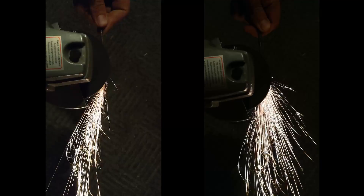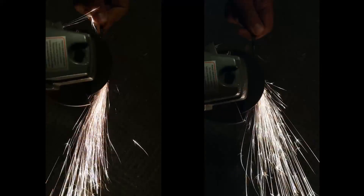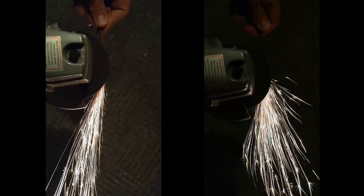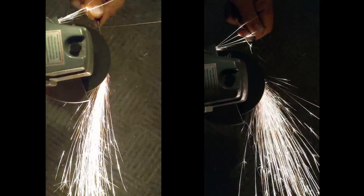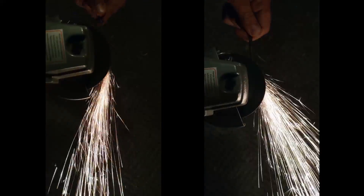On the left is an ordinary mild steel nail. On the right is a nail that we put through the Aristotle hearth. There's little or no difference between the sparks emitted from these two nails, meaning that they likely have the same amount of carbon in them. So unfortunately, little or no carburization took place. Most likely this is for one of two reasons: either we didn't run the furnace long enough, or we didn't have a high enough ratio of charcoal to iron.